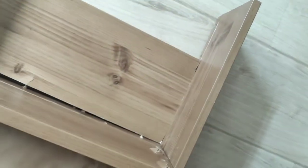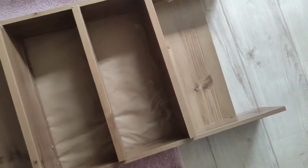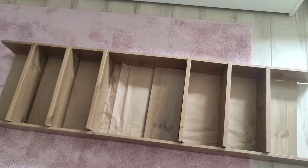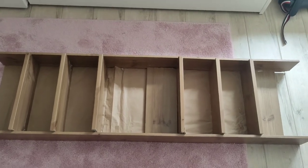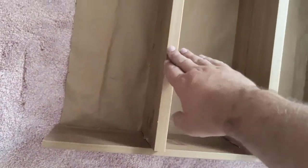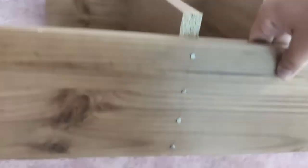And so I am preventing undesirable movement to a large extent. As you can clearly see, it's not exactly a marvelously precise work of art. But if you do not look too carefully, that may indeed pass as a shelf. And one further detail: when I was making these pieces here and setting them in, I made them to be a little bit slanted to the back, so things don't actually have a tendency to fall out, but to fall in, so to say.